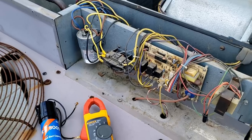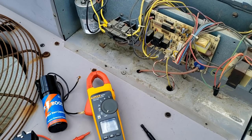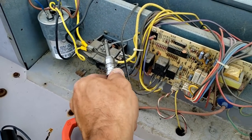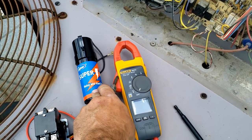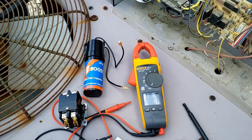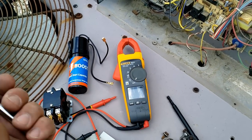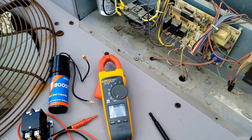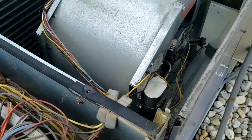I gave them the option — I said we could do something or do nothing. We're going to go ahead and update the contactor, and they're going to add a generic super boost to it. These are cheap — not as good as a true start relay type boost capacitor deal, but it's cheap. A lot of times around here people are economically minded.